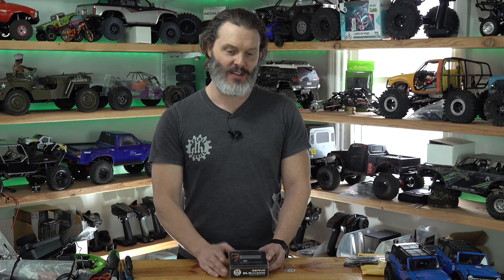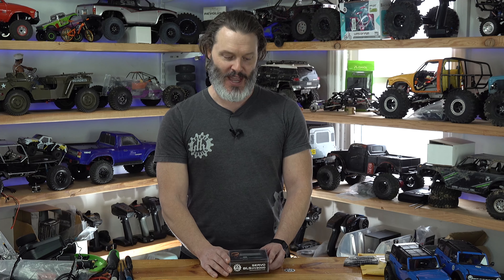You might want to run 3S, you might want to run 6S, you might be running 8S. I did not feel comfortable putting out a servo that may or may not perform to your expectations. If I tune it for best operation on 6S LiPo and you throw it on 3S, it's going to be a turd. And if I tune it for 3S LiPo and you throw 6S at it, it might burn up. So knowing that most people run between 3 and 8S on the SCX6, the only model in our catalog rated 5V to 8.4V is the HV2000.